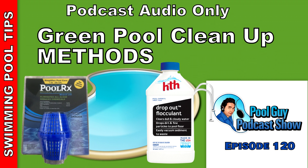If you have a portable cleanup pump, you could do the Flock method effectively in a DE or cartridge pool too. The reason I don't use this method here in California is that about half the pools I've done green pool cleanups on are cartridge and the other half are DE filter — and these filter very efficiently. So there's no reason to do the Flock method to drop everything to the bottom because the filter will actually do the job well in filtering out all the algae. With a cartridge filter and a DE filter, the steps are the same: you clean the filter, hose it off, recharge with fresh DE, and put everything back together.